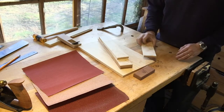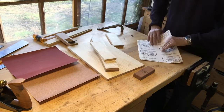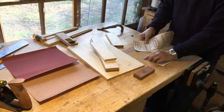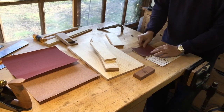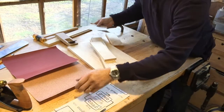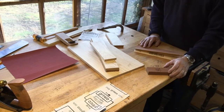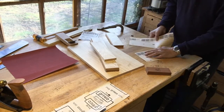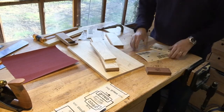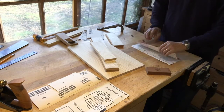And the way you sand it is very simple. You actually take a piece of sandpaper or an abrasive paper. You're going to fold it in half, just to break it. Then you're going to fold it in half again. Okay, and when you sand, you're going to find that it is easier to sand with a sanding block, which is this, a piece of wood. And a sanding block will actually give you more surface area to sand, and also it will sand faster. So we're going to need a 100, and then probably the last one will be the 220.